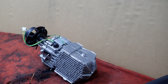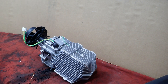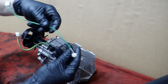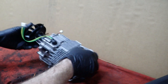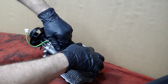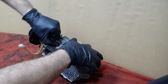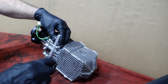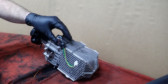What we'll want to do first is go ahead and pull this temperature sensor. It's just got a metal rod that keeps it in place — it's very cheap and it just senses the temperature off of the housing. Then we'll want to pull the glow plug next. This isn't going to be a rebuild video because I'm missing pieces off of this. When I sell that other heater, I'll just put these two together. This is the glow plug tool — the socket to remove it.